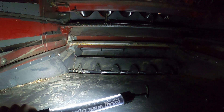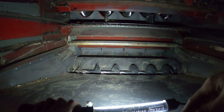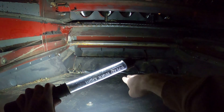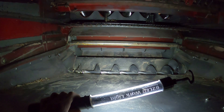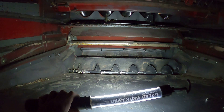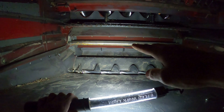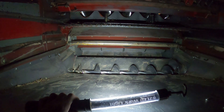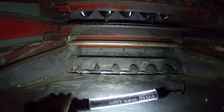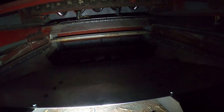Earlier when I was describing how the grain comes through — back here your sieves would be sitting up here — as the grain comes down through both sets of them, it would hit here and slide down to the auger down there. That auger augers it over to the side where the clean grain elevator is. Grain would come across up there, fall down onto the sieves; the first sieves let the bigger trash blow out the back, and then the second set of sieves, being shut a little tighter, would hopefully get just grain going through there, hitting this and sliding down to the clean grain.